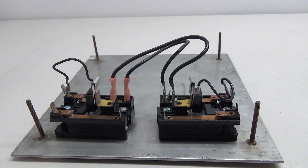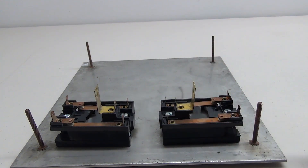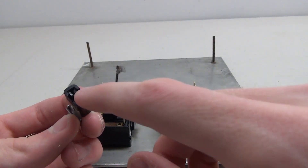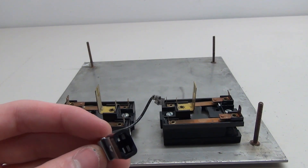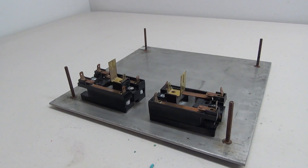Back to our button — I'm going to remove all the wires and lamp sockets and start from scratch. Here we have the base buttons with nothing on them: just the metal piece for the lamp socket and the two contacts. Before getting started, gather your materials. First, decide what sort of light you're going to use. In this video I'll be using incandescent bulbs, but I'll also show how you can use an LED. You'll want to decide on your voltage and battery pack — for instance, for a 3-volt LED you'd use a double-A battery pack. Figure out your bulb or LED type and gather the corresponding power supply. The wiring is the same regardless of what you use.